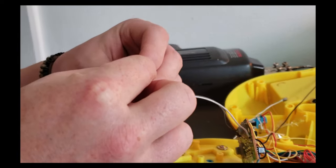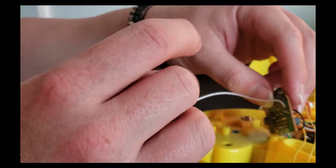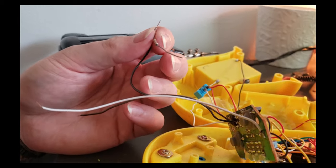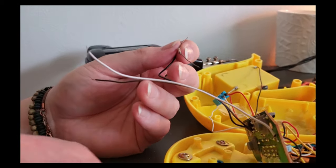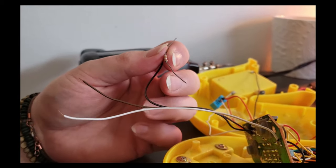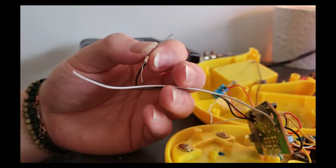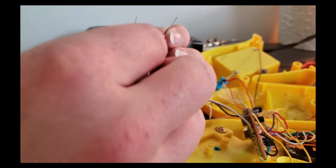So this appears to be our medium, this black one. We're going to go ahead and put that one on the switch. Actually, before adding this on the switch, I need to check where the resistor needs to go. The resistor could be on this high point right here, and that'll keep the instrument from crashing, or it could be in the middle, and that will actually in turn limit it from both the ground and the high point. So we're going to check its effect on the ground.